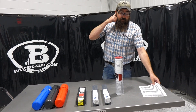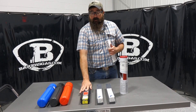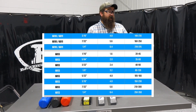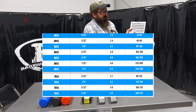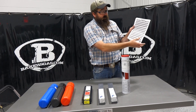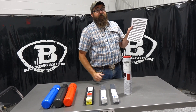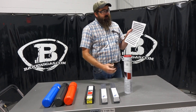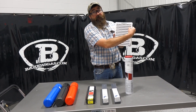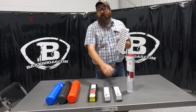When choosing amperages to run, we get a lot of questions about how to start out. For example: I've got eighth-inch 6010 — what amperage do I run it at? On our website, which we'll link below, we've got a chart you can print out that covers 6010, 6013, 7014, 7018, and other popular stick electrodes — their sizes and what amperage to run. For eighth-inch 6010 the chart gives a range of 75 to 125 amps; I would normally run it between 80 and 90, so about 85 amps.